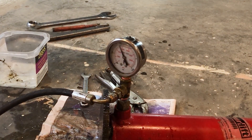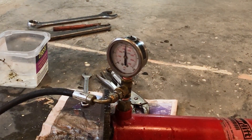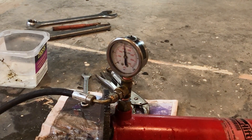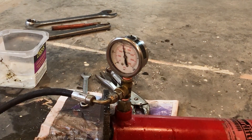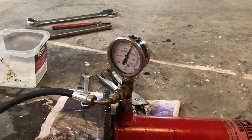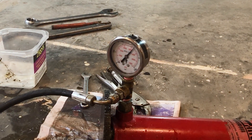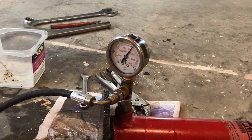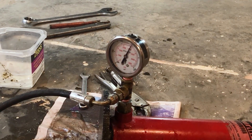So we're at like 1,000 feet. Whoa. We're at 500 PSI. Holy moly — that's unbelievable. Well, I don't need to destroy that because that's way more than I need. That's 600 PSI. So we are sitting now at about 1,500 feet of depth. That is unbelievable. But I see the gauge is dropping — I have a feeling that the oil is passing by the piston rings. That's just amazing.